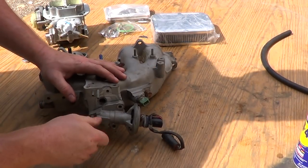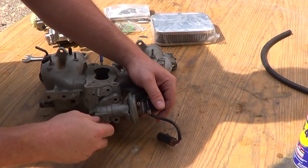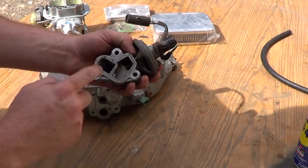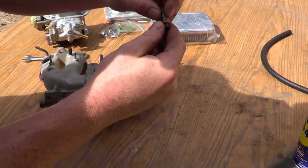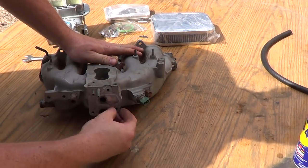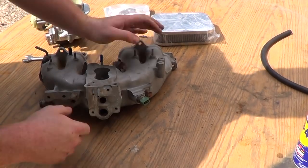I'm not going to show how to make this plate, but you can pretty much make a plate that goes over this. What I did is basically use that as a template. Make a plate exactly like that — quarter inch, 3/16ths steel, whatever. Cut about half of that off around the edges.